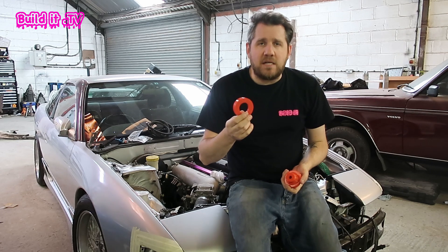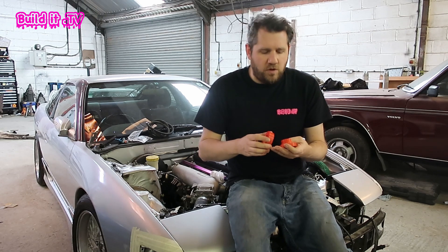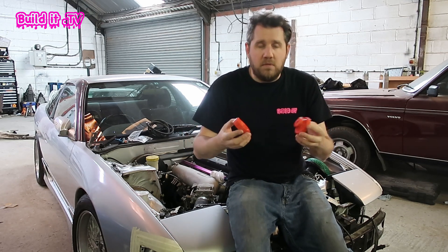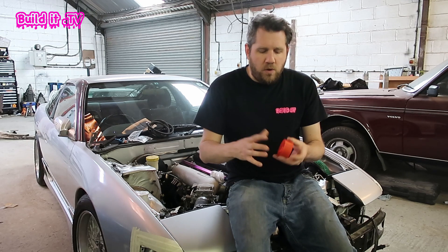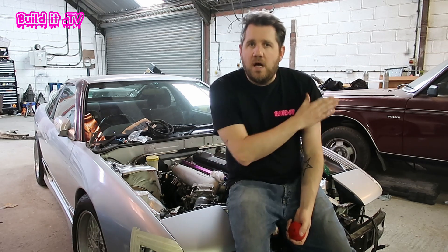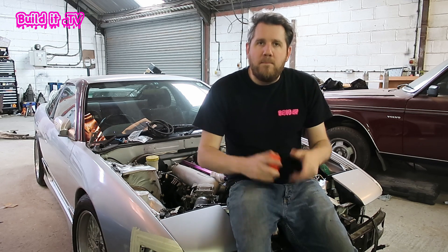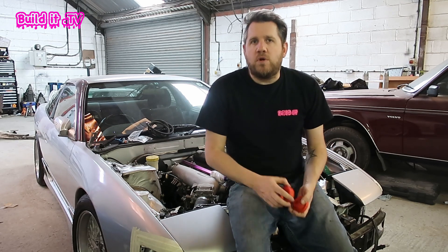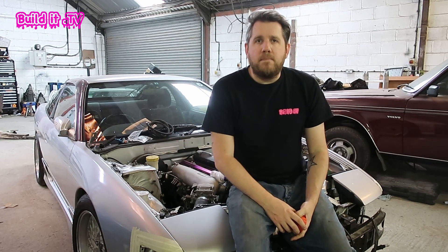Dimple dies are the cool-looking pressed holes you most often see at the edges of roll cages and things like that. The idea is to take a flat bit of metal, which would generally flex quite easily, and press a shape into it to create a more rigid surface. This tool — which I 3D printed, straight off Thingiverse, link below — I printed at 100% infill so it's completely solid. It even tells you what bolt to use. You could use it in a press, but I'm going to use a nut, bolt, and big washers and clamp it down. I'll start on thin material and work my way up until we either break this or win.